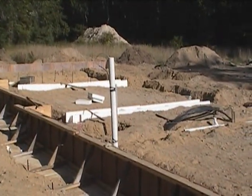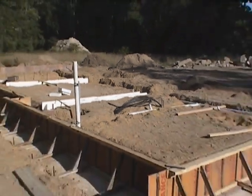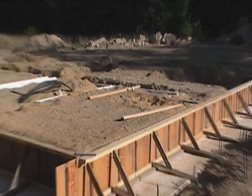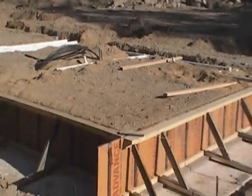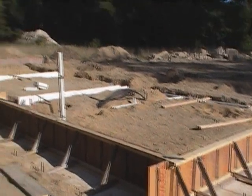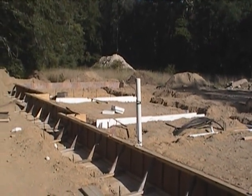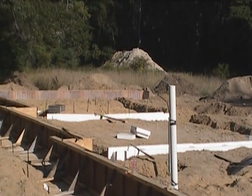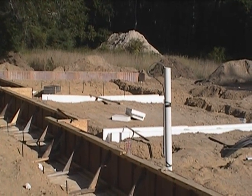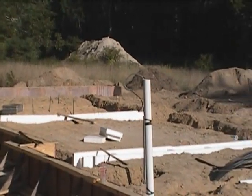Once they're done with their rough plumbing, we can grade off and fill their trench. And we can start insulating the bottom. We're going to put the styrofoam down over the dirt, cover that up completely, put a vapor barrier down — plastic over the whole thing. We're going to put a six-by-six welded wire set up an inch and a half, tied all together throughout the whole thing, along with two pieces of number four rebar around the perimeter. And then the radiant tubing will be attached to that, and once that's done, we'll be ready to pour.